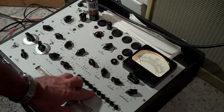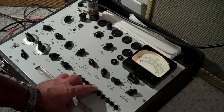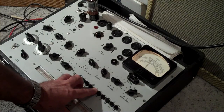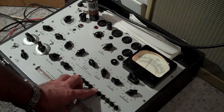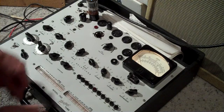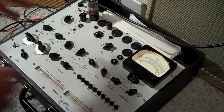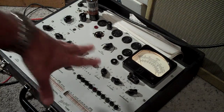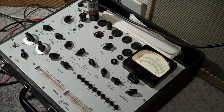What you do is check the micromhos, as they call it. Push this and I get a reading of about 530. I can also check the life of the tube. I recently bought some tubes that the guy told me he tested good, but when I put them on the tester it read about 50 — I've never seen a tube read so bad.